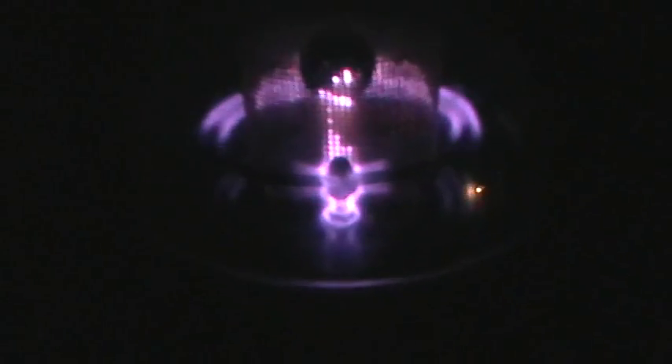As you can see, that right there is a glare spot. I'll just turn off the light. So you can see anode tufting, the pixels in the screen lighting up, and you can see the cathode glow starting to recede a little bit, which means that there's a slow leak.